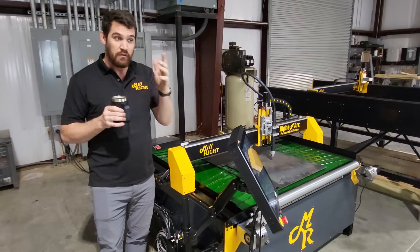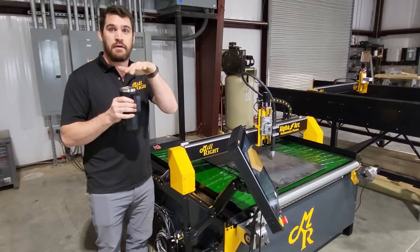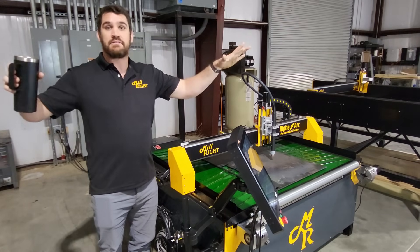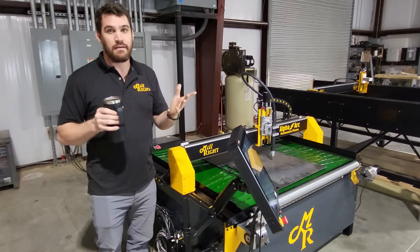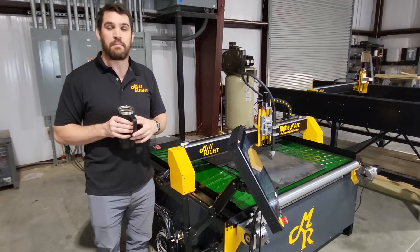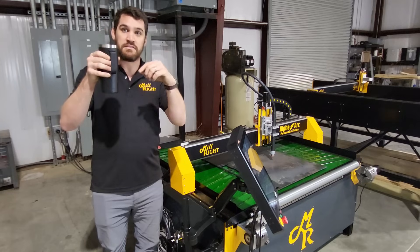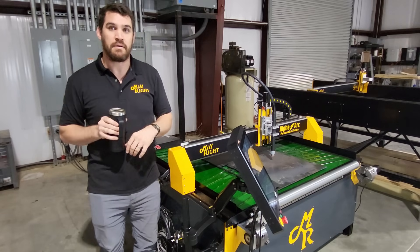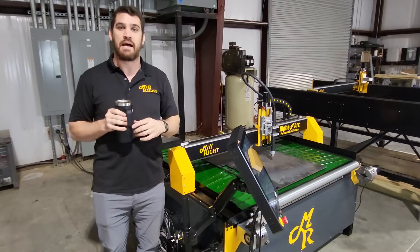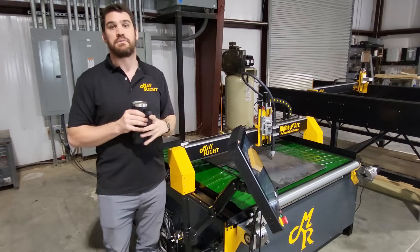The air ballast can be really helpful if you're cutting aluminum. There are some dangers to letting gas accumulate underneath the plate, so you might need to drop your water level to let that gas escape — check YouTube for accidents that have happened when aluminum isn't cut properly with a plasma cutter. If you want to use our optional laser cutter attachment, say you were cutting steel and now want to cut colored acrylics, you could drop the water level with the optional ballast system, swap on the laser head, and now you've got a half-sheet laser machine.